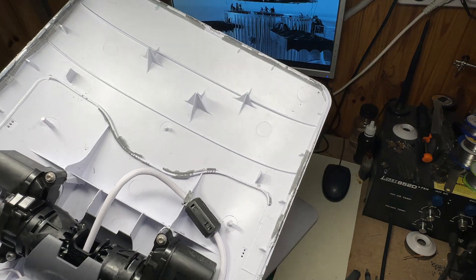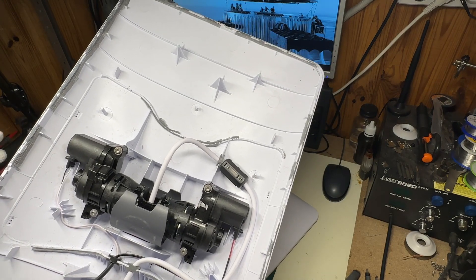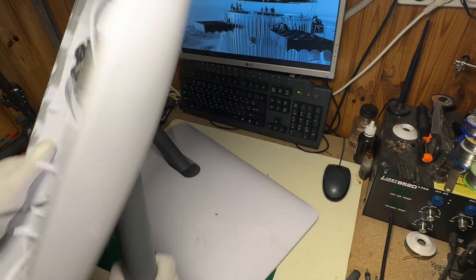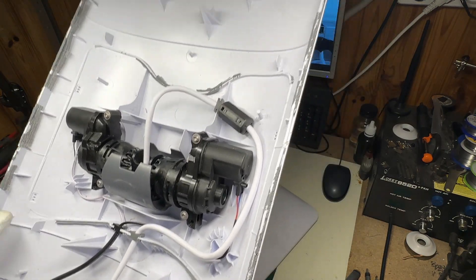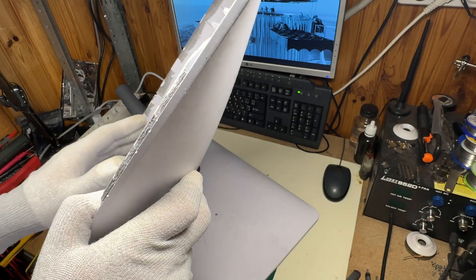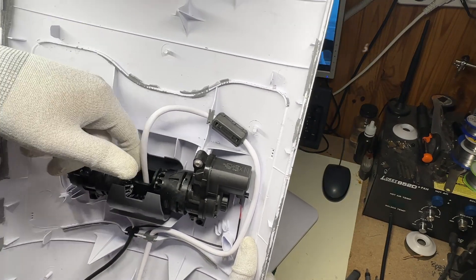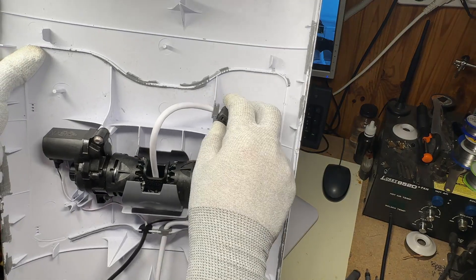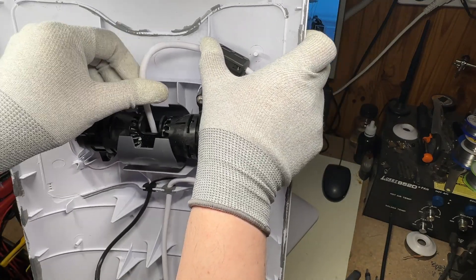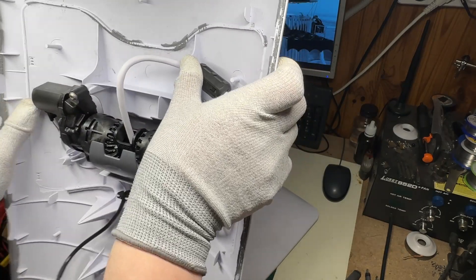This also fixes a small problem known as twisted cable. If the Starlink dish is quite often moving from one location to another, it constantly rotates to find the best position. It may happen that the dish rotates in one direction more often than another, and as a result this cable will be twisted around the axis of the tube. This side is fixed to plastic and the cable can rotate with the tube, so if the tube is rotating the cable is also twisting and it might be damaged.